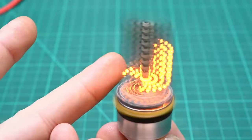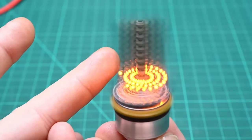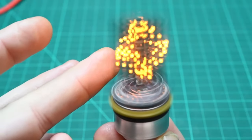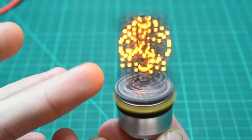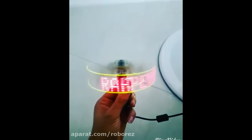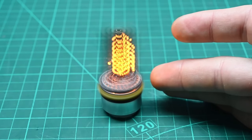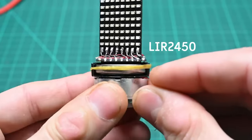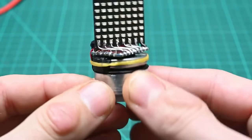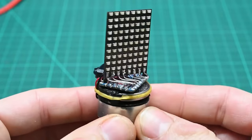Through YouTube, I learned about this tiny volumetric display by Mitxela. Most volumetric displays involve 3D arrays of pixels. Sometimes they're LEDs, and sometimes they're stacked transparent displays. But Mitxela is taking a page out of the playbook of those spinning POV displays and adding an additional axis to it. They've got a one-sided LED matrix that's mounted vertically on top of a CD-ROM drive motor, along with an IR sensor and even the coin cell battery powering it all.